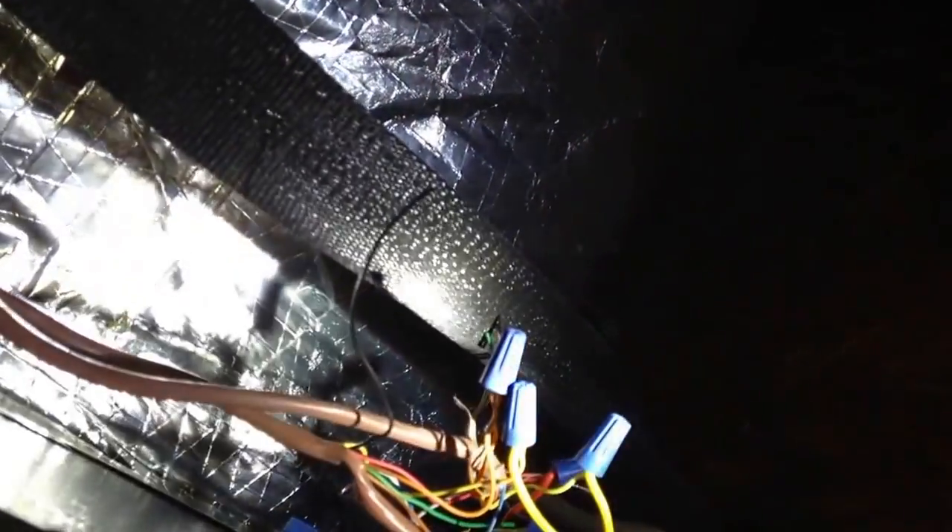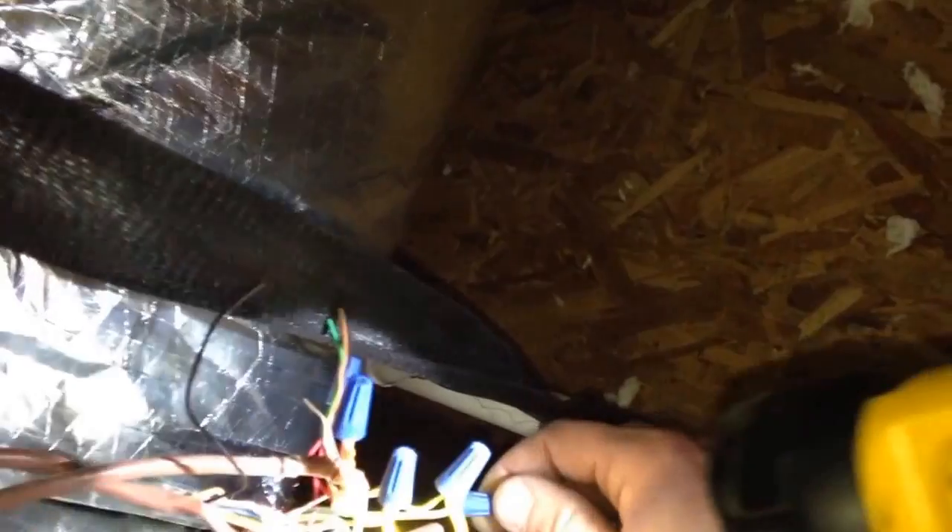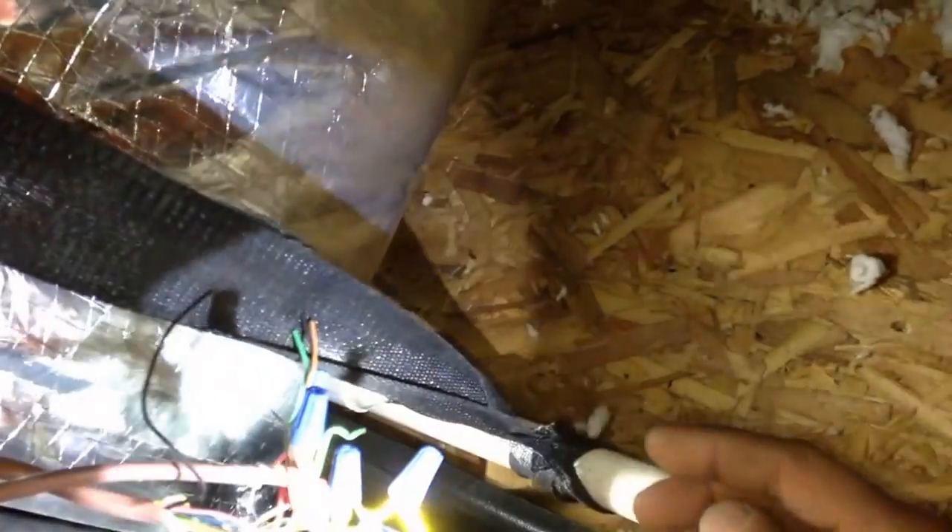The new disconnect is in and we have power back on. Surprisingly enough, that burned-out box did not trip the breaker. We noticed that the low voltage wire for the fan control was broken, so it should not be caused by any of the low voltage controls causing a fault. We confirmed that the heat strips were not running — only the blower — which means the amp draw would have been lower than if both were running.